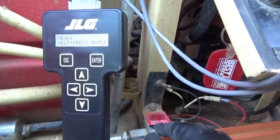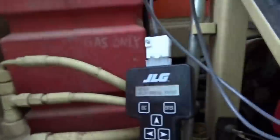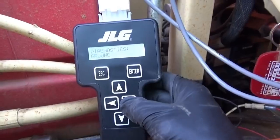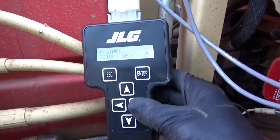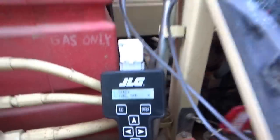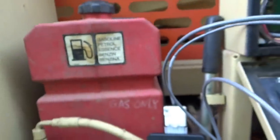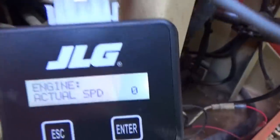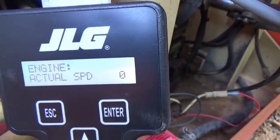So I believe there's some intentional shutdown going on, and the battery's completely drained. What are the chances that if the alternator is not producing an RPM signal, it just shuts itself off? We've seen Genie lifts do this. Let's go back into diagnostics - engine - and see if there's an RPM signal here. I'll connect the boost pack first. Push the button, see what engine speed is. Ooh, that's a clue.